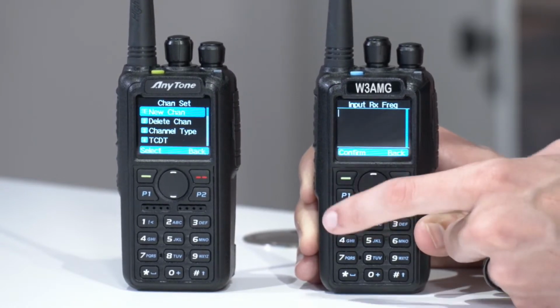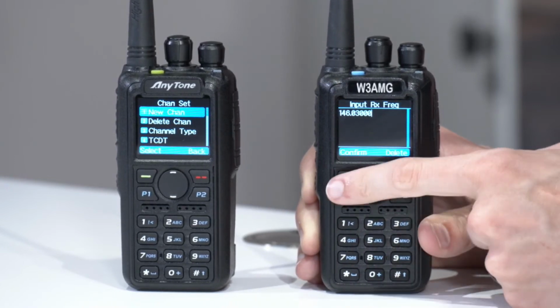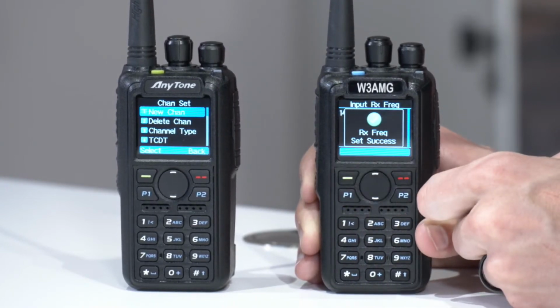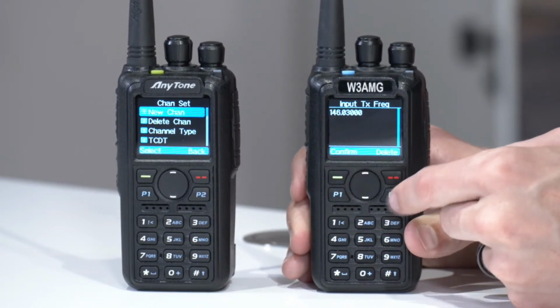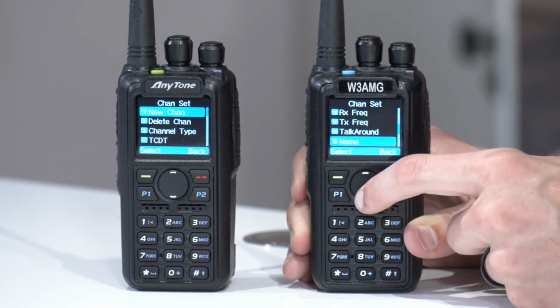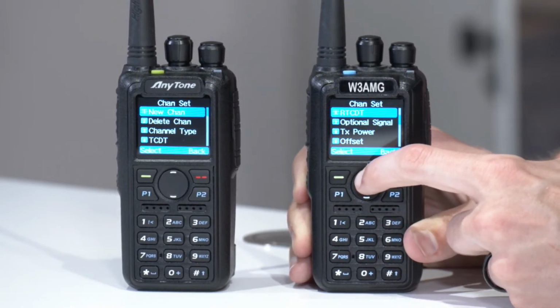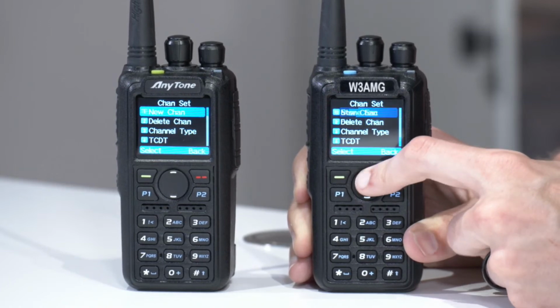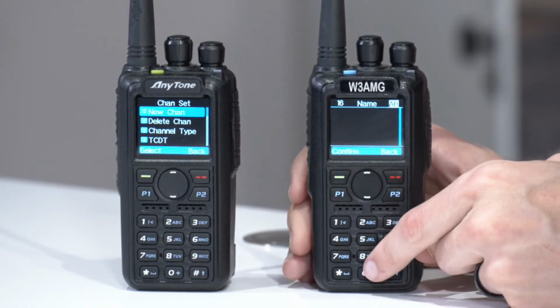We'll set the frequency to 146.03 pound, confirm. Perfect. Make sure that's the same, which it is. And we should be set there. Let's add it to a zone real quick. New channel, confirm, and then give it our name.